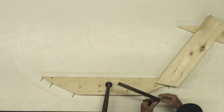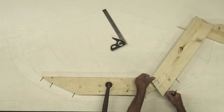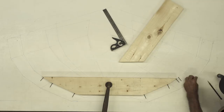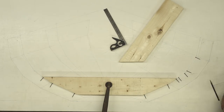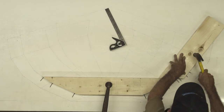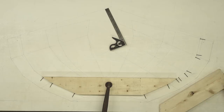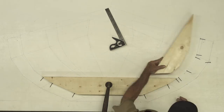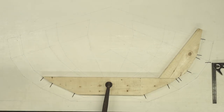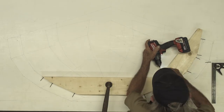I'm spacing it up off the table at the top. Once I've got it sitting where I want it, I can reach right underneath and draw a nice clean pencil line. Then I'll take it over to the bandsaw and cut that. I might have to fit it a little tiny bit, but once it fits just the way I want it, I'll take it out of place, add the nails into the table right there, carry it back and fit it where it belongs — hovering over those nails a little bit — then put a little pressure on it. Pound on it so I can connect up the lines and take it back to the bandsaw and cut it. I lift the bevels and add the bevels to the cut.